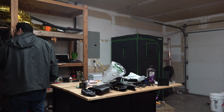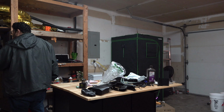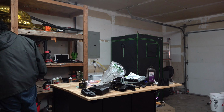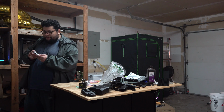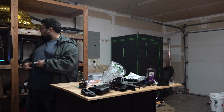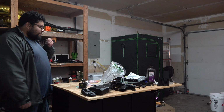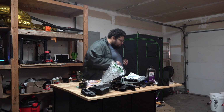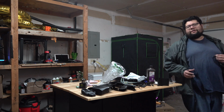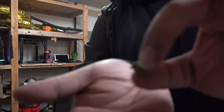Although, thinking about it, that would be a mistake to do with this PETG. Well, it'd be a mistake without the glue stick. So, yeah, I suppose I will have to end up doing that. I'll run the glue stick on the glass bed, and that's how I'll do the PETG to get the rest of the parts for that KlackEnder printed and looking good. I wonder if this piece of wheat renders really well. What do you think? Sorry, the heater's on.